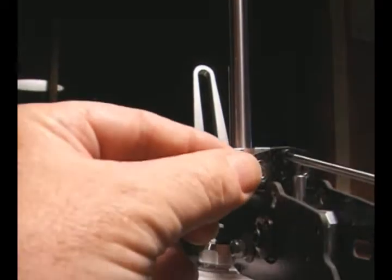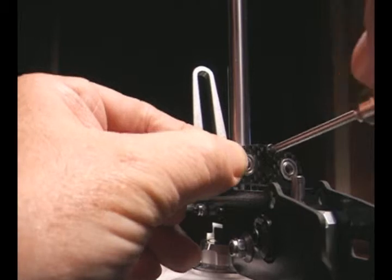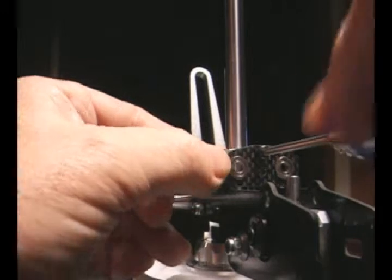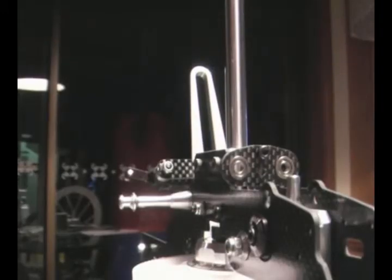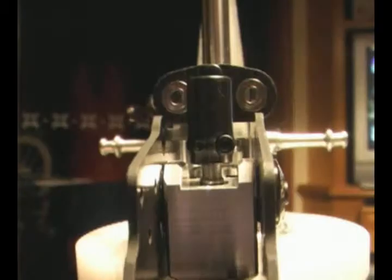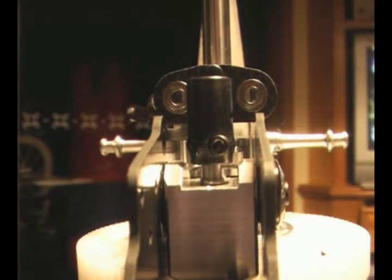Nice simple job now. I like the easy ones, just securing our cyclic servo shafts onto the upper bearing block, flanges pointing towards the front, and Loctited in with two M3 by 6mm bolts. And that's our starter coupling with its two M2.5 by 6mm bolts, a combination of clamp and fits into a machined recess. Very nice too, and that looks like it takes our standard 6mm starter shaft.